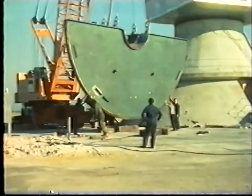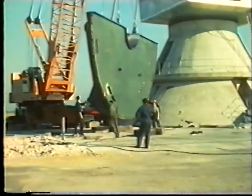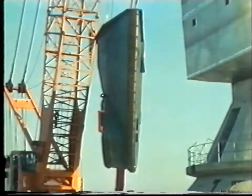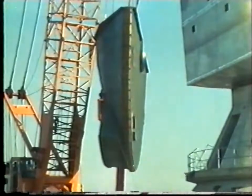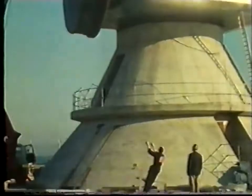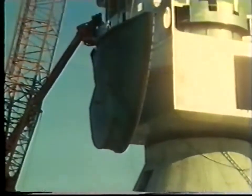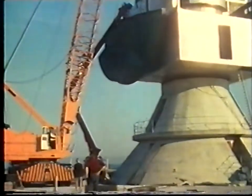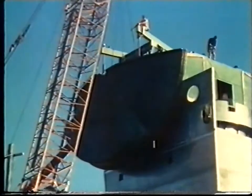The aerial is driven in elevation by two semi-circular racks, one on each side of the rotating platform. The pinions which engage with the racks are connected together by a torque tube to give increased rigidity and to prevent differential movement. One of the toothed racks on its massive mounting is being offered up to minimize friction.